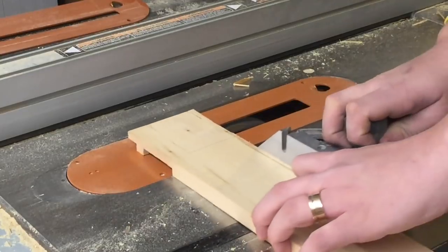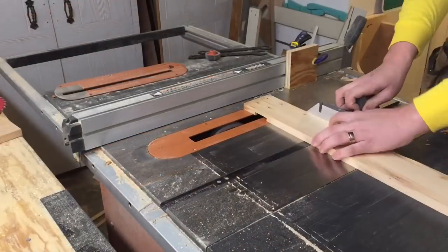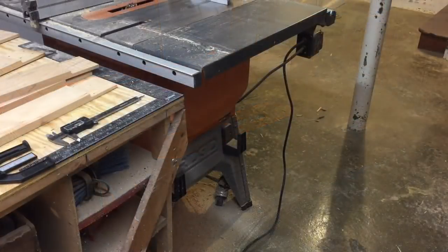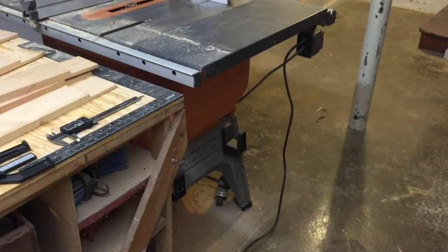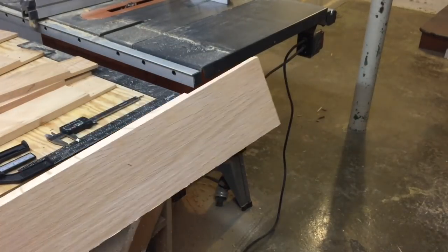Given the thickness that these legs were after planing, I thought the strongest joint was going to be a half lap joint, so I set up my dado stack and did half laps on all the legs and the back piece. Looks like somebody was being silly and tried to make a half lap joint over a knot — but oh well, I had just enough scrap from the piece of oak to make one last leg.